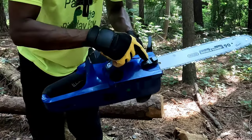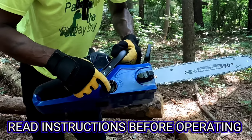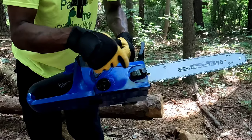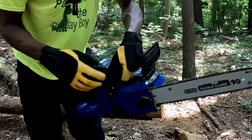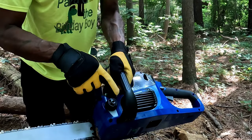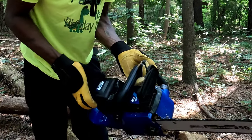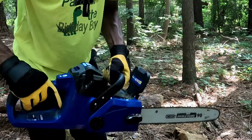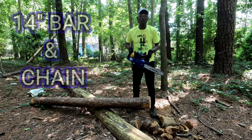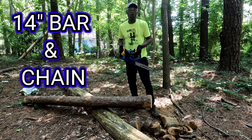You also have adjustments right here on the side. You can adjust your bar and tighten your chain right here — loosen your bar, twist it, you have plus and minus on both the bar and the chain. You can loosen them. As well as you have bar oil right here — a spot for bar oil — so you definitely need to fill it up with bar oil because it will help prolong the life of your chain. And this thing is what we call a beast. It does have an Oregon bar and chain, which can be easily acquired from your local hardware store.